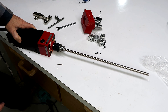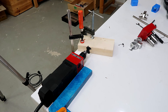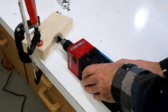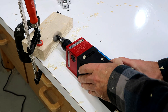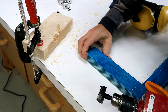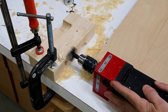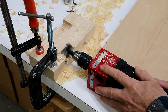That's pretty good for a drill. The idea of this drill is that it's easy to jig something up because you can just guide it like that. I'll try to make a rather difficult partial cut with a Forstner bit into a piece of wood. The drill feels super solid, but I think this may not be stiff enough to do this successfully. So I swapped out that square for a big piece of plywood for more steady support, but that drill still got away on me a bit. So for my next test I just drilled square into the wood, which made it much easier, but still a bit too much cutting force with that big Forstner bit.